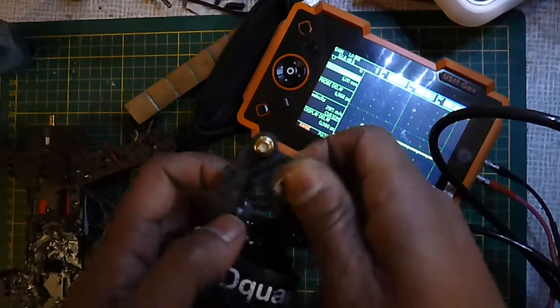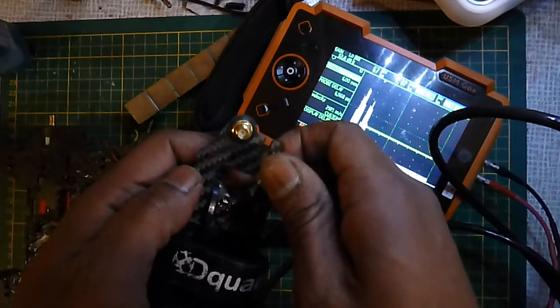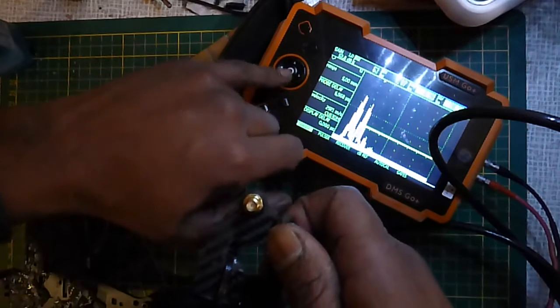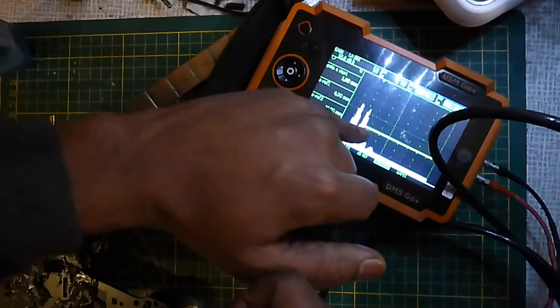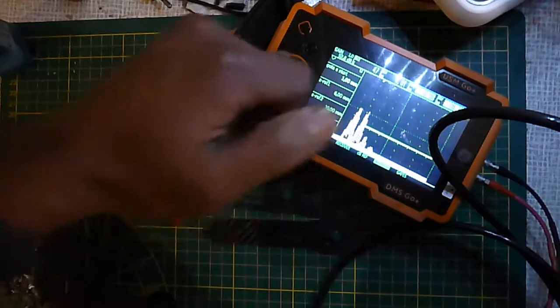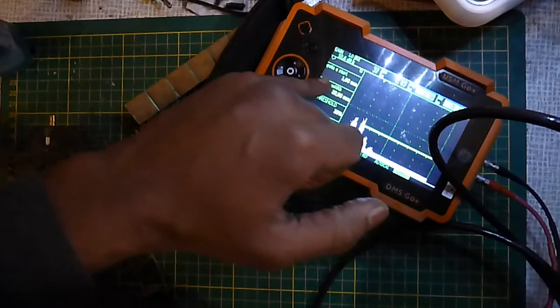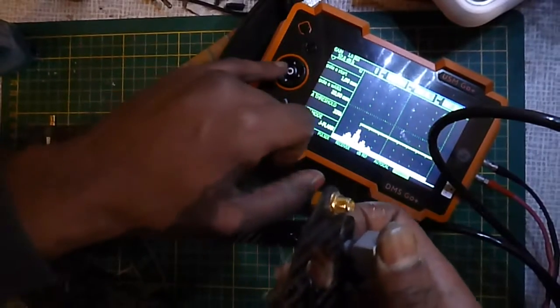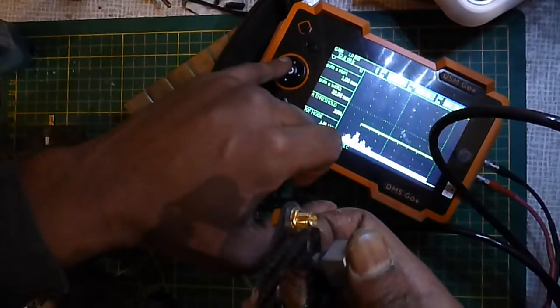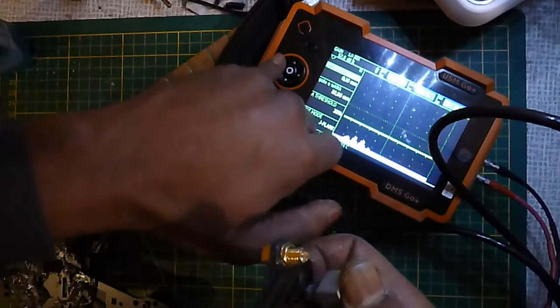I'll just adjust it to the normal height, and it says already it's only 1. On the better part it says 1.4, and it's sold to me as a 1.5. And if you look here, it's way less than 1. Adjust my gate, because the number displayed here is from this gate. Sorry for my English again. But this gate is now starting on 1 mil. So it looks like it's only half a mil thick. And that would mean somewhere in my first lamination something went wrong. Well, not wrong, just bad quality, boys.